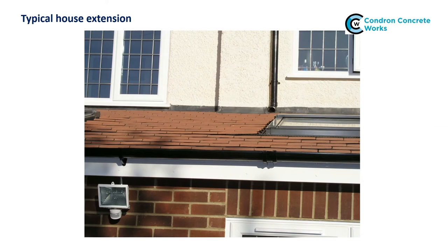A good example is a house extension where the tiling may not be perfectly flat if, for example, the tiles pass over roof window flashings, or where the tiling may have to cope with extra water runoff from a higher roof slope. This one has water shed directly above the side junction with the roof window — very bad practice. Condensation can also form in the batten cavity as water vapour passes through the breathable underlay from inside the building. So it's important to design and build the roof to allow any water that does find its way into the batten cavity to drain away safely to the gutter.